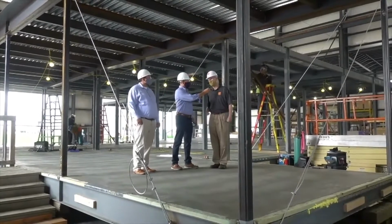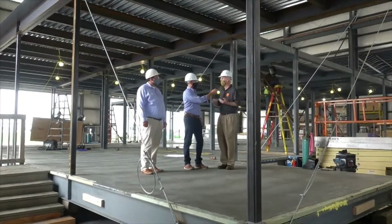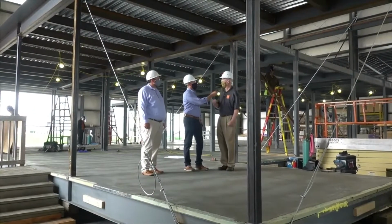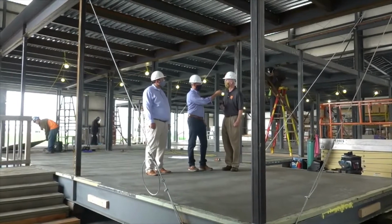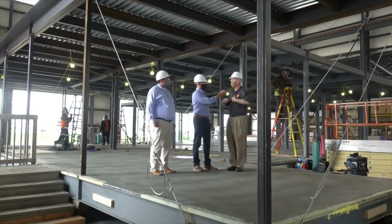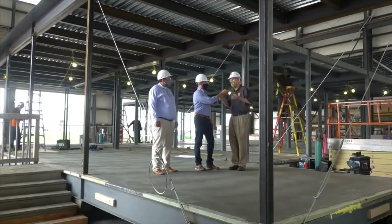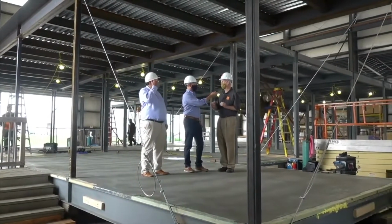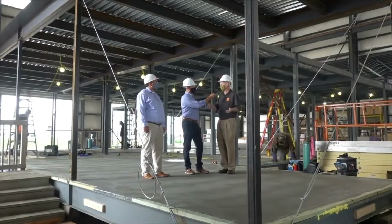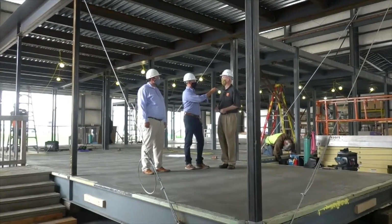We look at the initial drawings presented to us by the architect, and then we take that initial design and we look at how we can split that up into various modular units. Fortunately, in this project in particular, the architect took a proactive approach from day one that it would be a modular building, so it makes our job a lot easier. As we begin the process of creating the modular units, we look at how the steel could be laid out, how it could be generated into individual mod units, and each modular unit is its own structural component. It's a free, standalone structure. Right. So as we lift each individual box up, it basically is its own individual building. And then as those individual buildings come together, they ultimately become the total building.